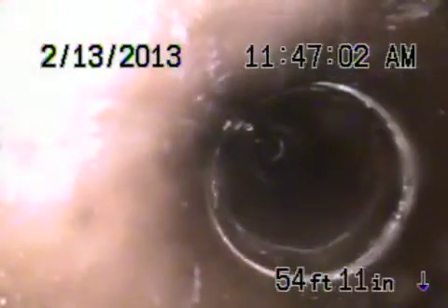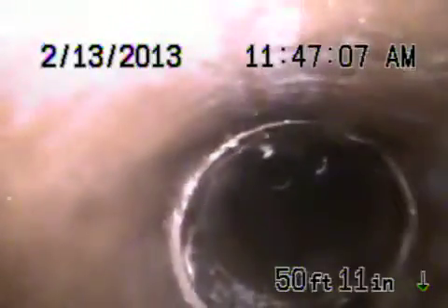This is going to come back as four-inch clay pipe. There's a little bit of a cracked coupling there, as you can see. As we come back, this is all four-inch clay coming back towards the house — also a little bit of a cracked coupling there. You can see the crack spreads all the way around. Also a cracked/broken coupling there, and another cracked coupling. The four-inch clay pipe is pretty badly cracked up — you've got another crack there, so every four feet.